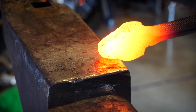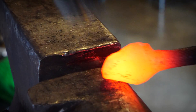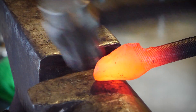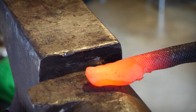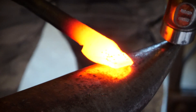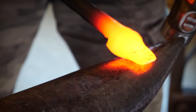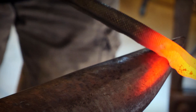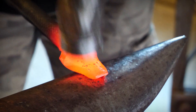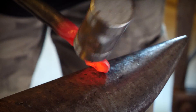One problem you can see by forging in this way is that the sides of my snake's mouth end up being uneven — the side that was under the anvil ends up a little different than the side being struck by the hammer. Then I flip the head around and try again from the other side to match everything up. I end up getting it eventually in the next heat, but it's very finicky. As I'm forging the head of the world snake, you'll notice a slight buildup along the edges of the side of his mouth. This is intentional — I want material underneath but not on top. We end up using that mass to try to cut fangs into the mouth of the snake.